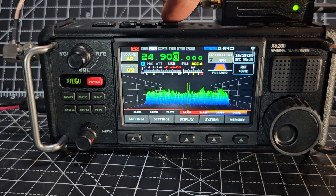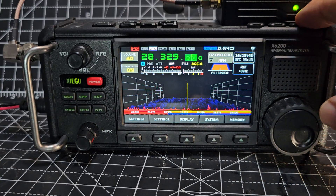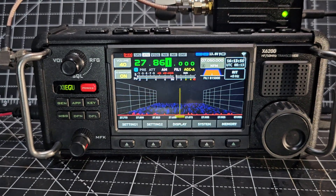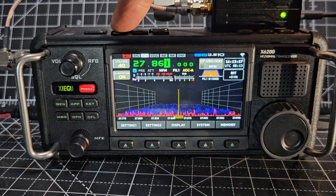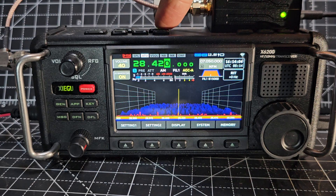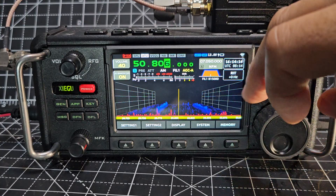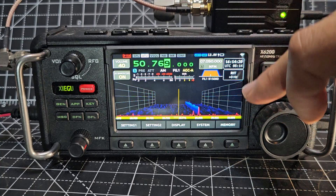For those that like the CB frequencies — you can open the TX on this, but I'm not going to do it right now. Let's try the different modes: AM, NFM, wide FM. So we've got FM on CB, so you can listen to that obviously. 10 meters, 50 megahertz — and I can get FM. There is a local repeater on 50.770 in Somerset, and obviously you need narrow FM for that.